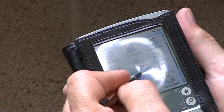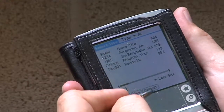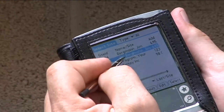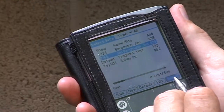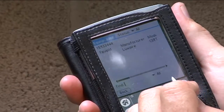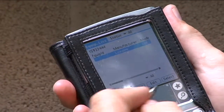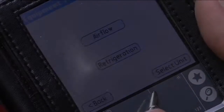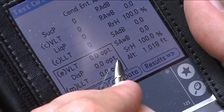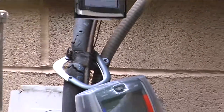While it's running, we're going to go ahead and get GetCool started. I've gone ahead and inserted a site — the site is Jim Bergman — so I'll select that site and press the select key. It comes up with a name and address, and I'm going to say next. We'll select the unit, which I've already put in, and do a refrigeration test. The first thing we want to do is get data out of the 556, so with the unit having run for about 5 to 10 minutes, we're going to press the print key and the data will stream via IR right into the palm.